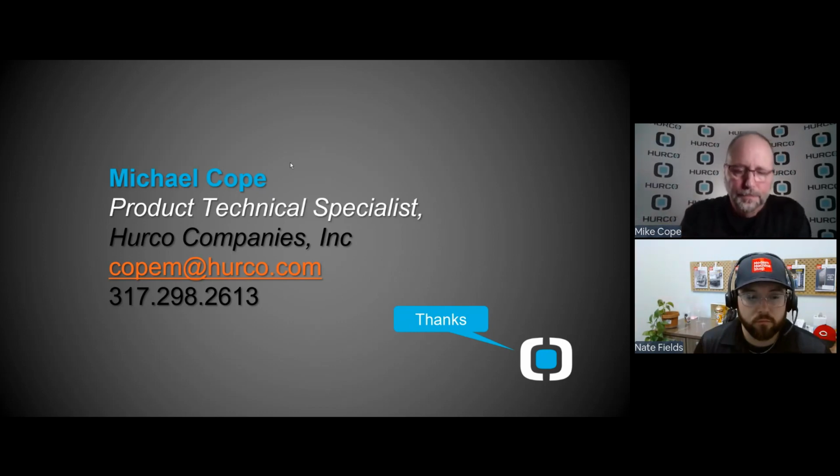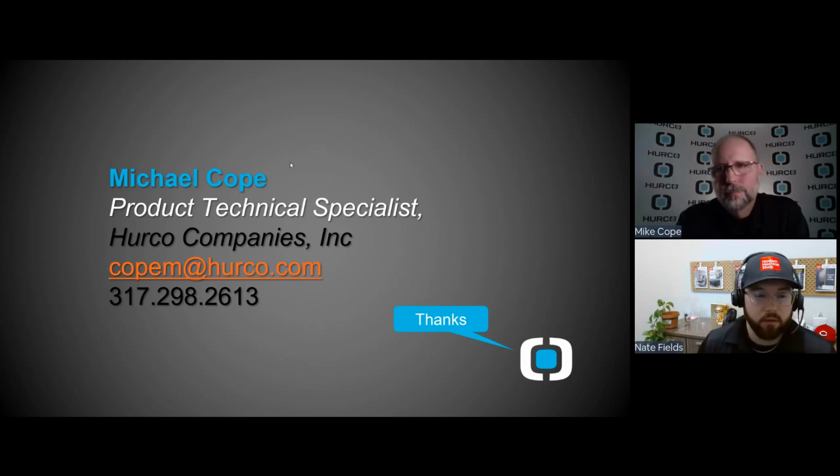Gotcha. And next up, typically 5-axis machines come with 30 or 60 or 120 automatic tool changer. Do you find 30 tools to be too low, or do most people require 60 plus tools? It depends on the type of work you're doing, because you are definitely going to want more tools than you typically would have in a 3-axis setup, because you're going to be doing multiple operations.